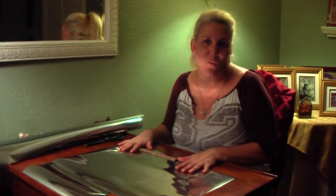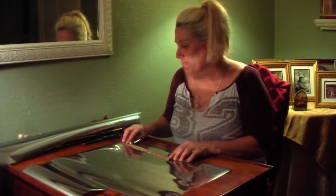I'm applying it to the front windows and door, and the windows in the back and lower level, because the sun comes through around five o'clock — closer to sunset — so those are the ones that really need it. The low-E film blocks out sun rays — I think it's 97 to 99% — and that's going to keep the heat out and the air conditioning in. In the winter, it'll keep the cold out and maintain the warmth inside, helping us with our energy.